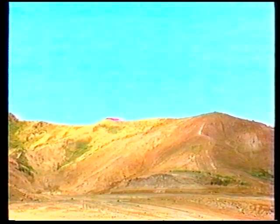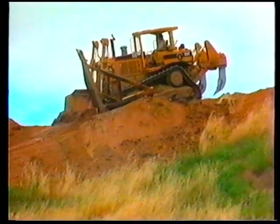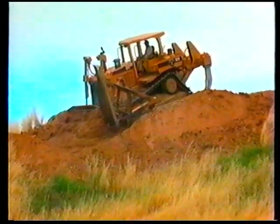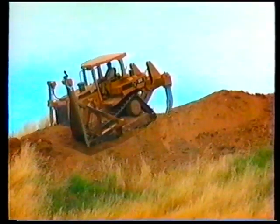Project an imaginary line from the starting point at the approximate angle down or up the hill that you want to build. Then determine a target point at the other end. Choose a marker at the end point, such as a rock, a bush, or place a lath there as a reminder. Once beginning, start the cut about 5 feet above the proposed road grade. This allows you to generate the necessary dirt to sidecast and establish your footing without undercutting your road grade.